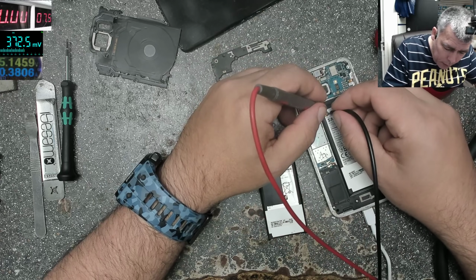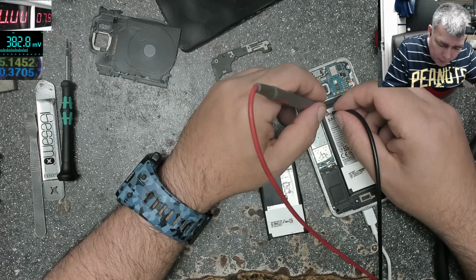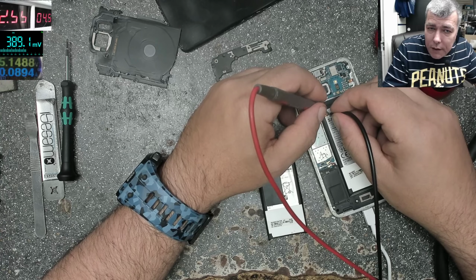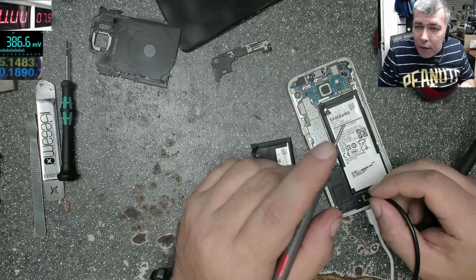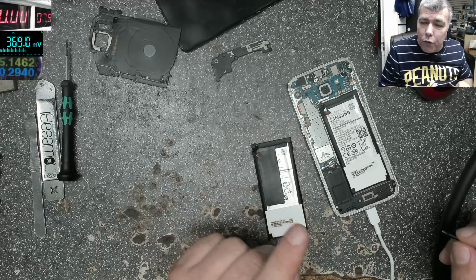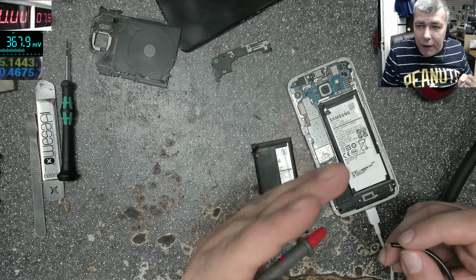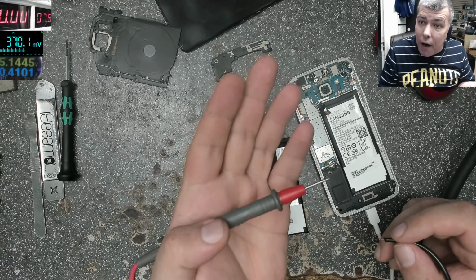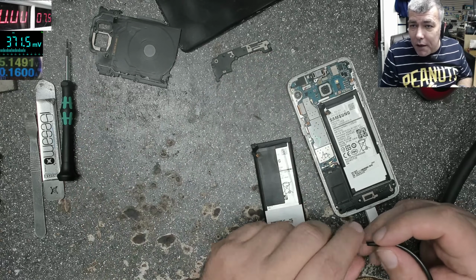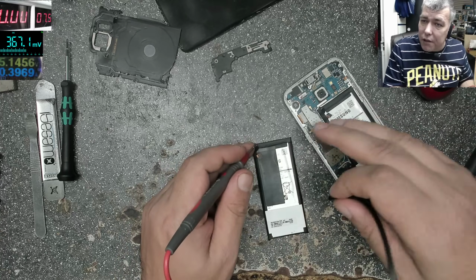But also we can check the battery health. In this case, the voltage got dropped to 4.5 volts. What about if the voltage gets dropped to 4.8 volts? What does that mean? This means my battery has a higher resistance, and that's not good. That's a used battery. The resistance goes up, the capacity goes down.